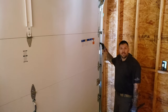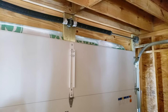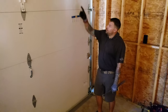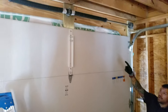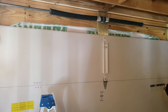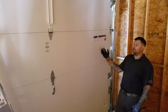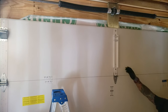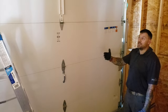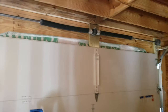Not a lot of people say, 'I haven't had my garage door looked at in a while,' but it's definitely something you want to do. When these cables and springs break, it'll scare you — it's very dangerous. If the door's going up, that 200-pound door is going to come slamming down on you. A lot of the time they won't break in the up position — it'll break when it's down. You'll be sleeping and you'll hear a loud bang, and in the morning you'll hit the button and the motor will yank the top panel out because it's trying to carry the weight but the springs are broken. We tell people to do it every time you turn the clocks back. For $59, that's a great deal.